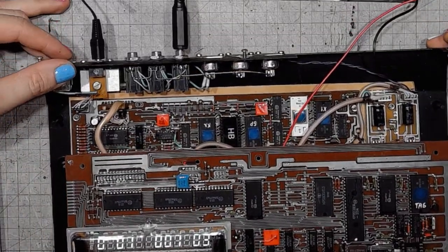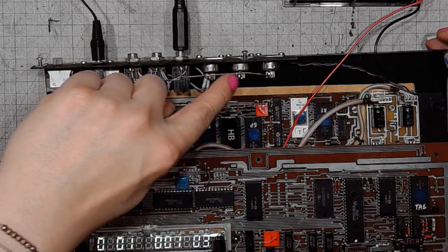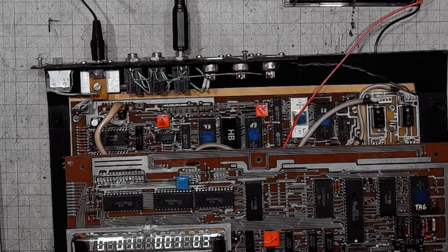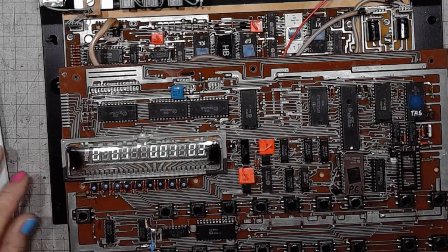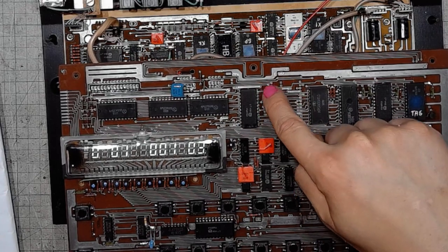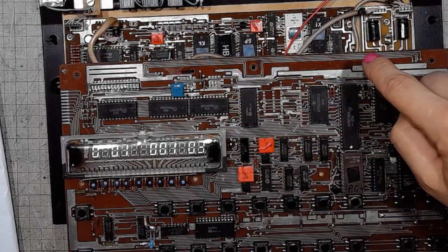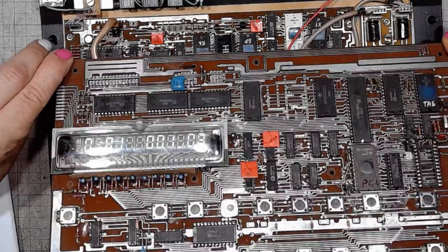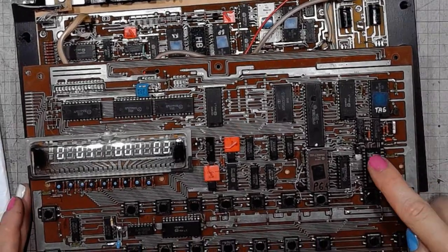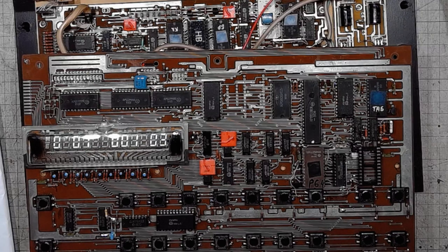And if you take a closer look here, those are the MIDI connectors, both the DIN type. They are not soldered at all. And the manual mentions them. Originally, there would be a UART interface chip right here, and an optocoupler placed right next to it. And this would probably be the MIDI connector. But those parts are missing. Just like the additional firmware ROM was missing. Maybe some initial versions of the Lell PSR featured those components.